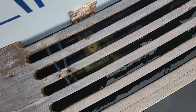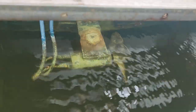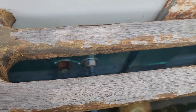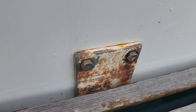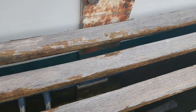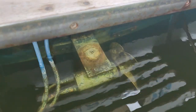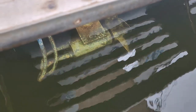You can see the thruster down there. There are two hydraulic lines that go through bulkhead fittings above the waterline, so that's not a problem. The mount is mostly above the waterline — that's a big stainless steel plate, and I think there are a couple of bolts above the waterline too. Not much goes below the waterline. There is a zinc on there — you can see it wearing away a little bit. I have a diver who comes out, cleans the boat, and cleans the thruster.